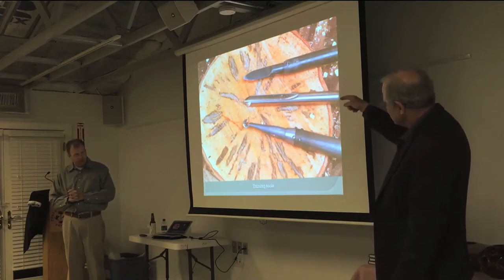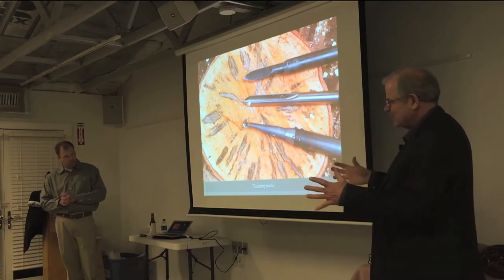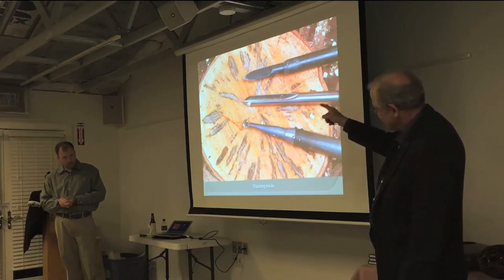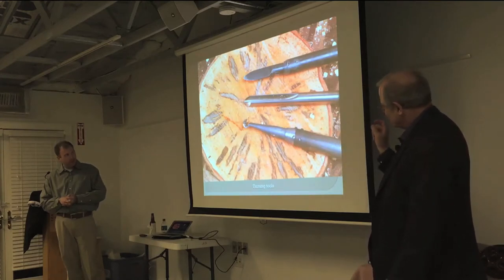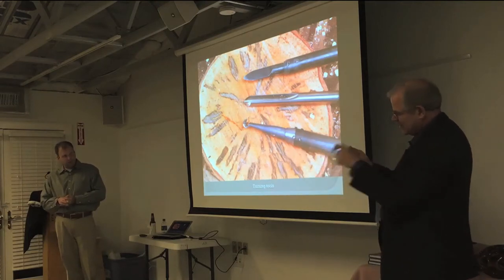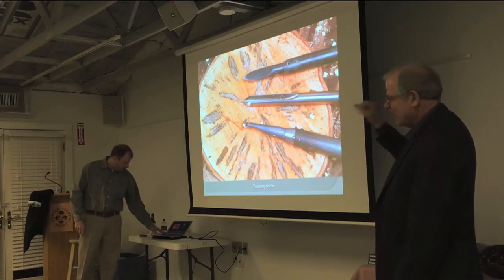The second one is kind of a commercial type of tool. It's a gouge. What we do is we buy the points and reset them back into our big handles, so our tools are about this long. The bottom one is a hook tool. It has a cutting edge all around that curved hook, and that is only for hollowing out. The hook part, the way it goes in, is cutting on the front, and then if you swing it around, it's cutting as you bring it back, and you're pulling it around. So that's used for just about all the hollowing.